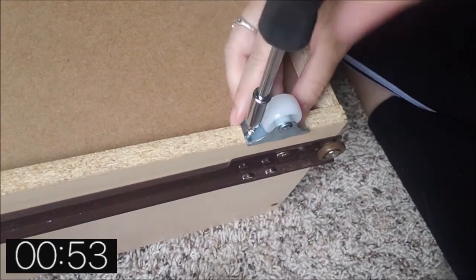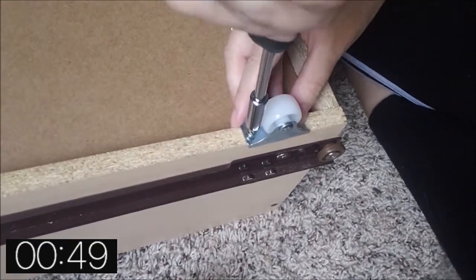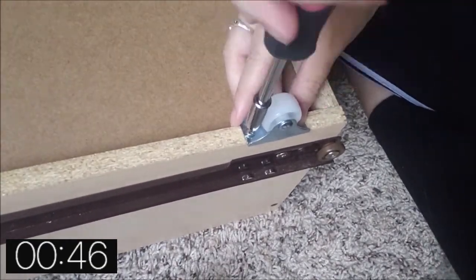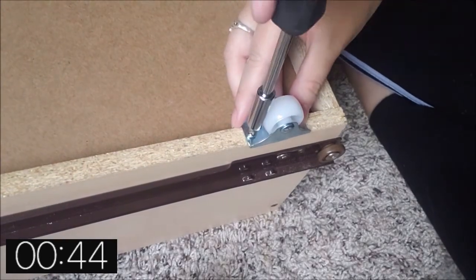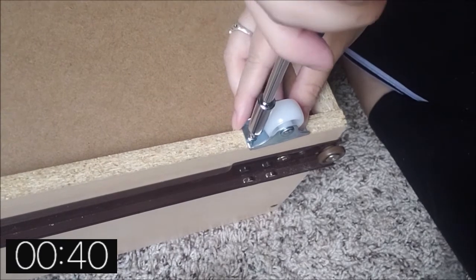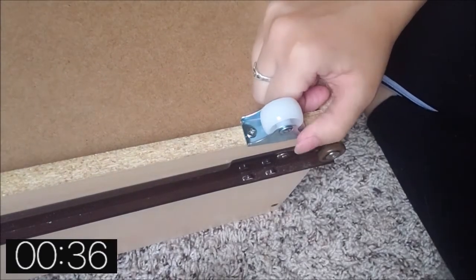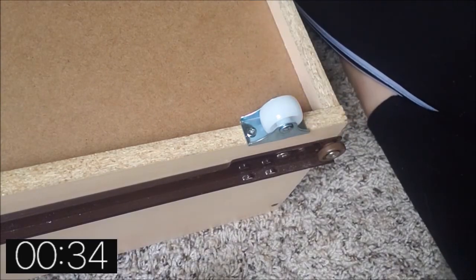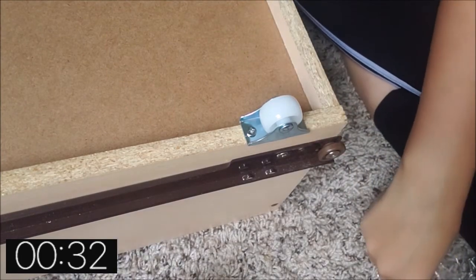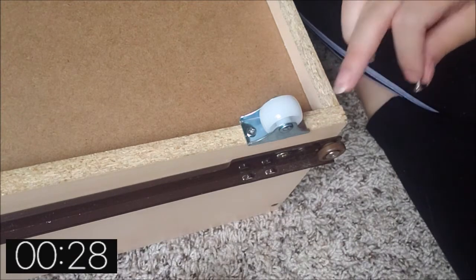And because the pilot hole has already been made, it goes straight down with minimal issues, and it will not split your wood. Got that down as far as I can. One extra tighten just for good measure. Once you have one, it still should be able to be rotated around a little bit as needed, in case it got off its mark while you were going.